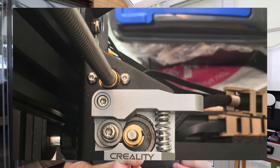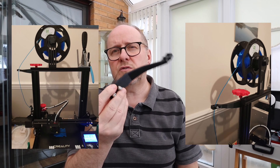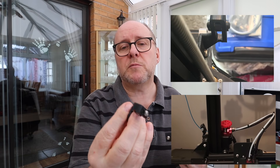The printer is designed to take the roller on the top, but the filament comes off the roller and into what they call the extruder — the drive mechanism where the filament goes through. You can print a filament guide, but you need the little nuts and bolts. This filament guide takes it off the roll and holds it away from the printer so the filament can go through smoothly. If you're running outside of an enclosure with filament on top, that's a good print to do. At the bottom end, I got a little ball bearing roller. The original is brittle and if it gets pulled or jammed, instead of unreeling it could snap off, so this helps the filament go smoothly into the machine.